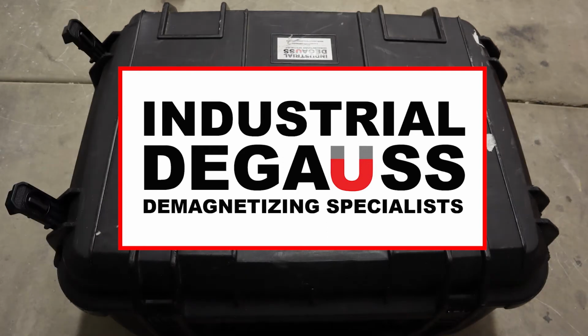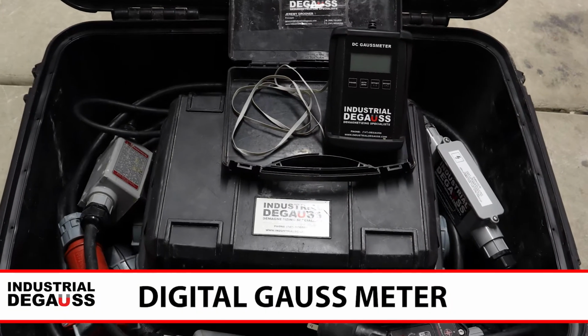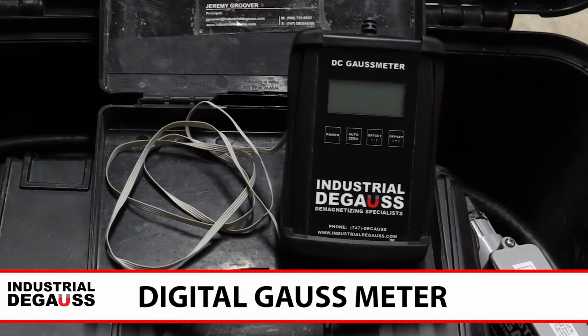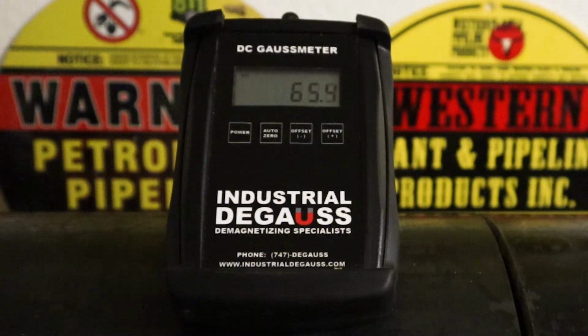The industrial Degauss IDMAG unit is a small field portable unit. Everything you need to complete your demagnetization is in one carrying case. Every unit comes with a digital Gauss reader. The digital gauge will give you a more accurate measurement than the traditional analog gauge. With a more accurate assessment of the problem, we can more accurately reduce magnetism.